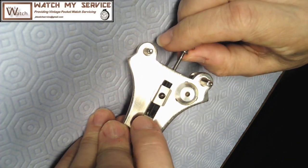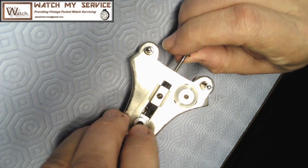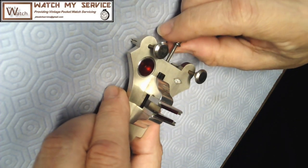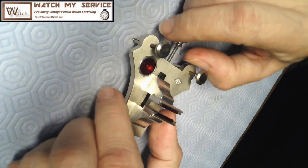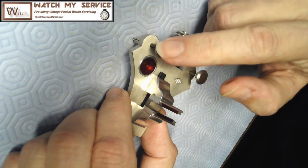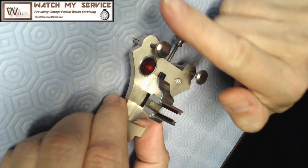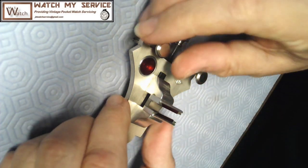You can see on the inside there's a little bubble that's very slowly moving towards the center. Your table might not be level but the poising device needs to be level. You just move the legs up and down - this leg is solid, it won't move. You adjust the other legs: if you adjust this leg higher the bubble moves that way, then you have to adjust the other lower, but then that side is higher, so you have to play the game of adjusting.